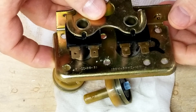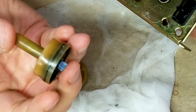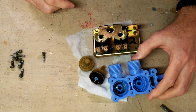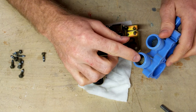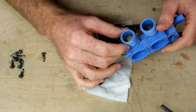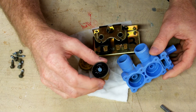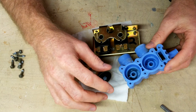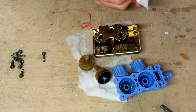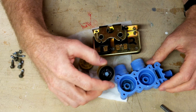On this side, we have two solenoids that when activated, cause the steel rod in here to lift up or go down. That's pretty much all there is to a water valve. It would be really nice if these screens were removable easily — they're pressed in and kind of difficult to remove, not a good way to clean them out. Once they get debris in there, you can foul up these seals so they no longer seal properly. It's important to keep them in working order, but sometimes small enough particulate can get by, or the rubber just wears out from use.